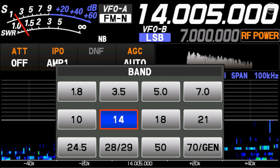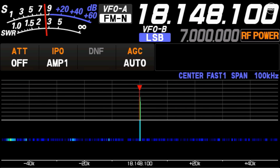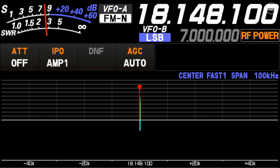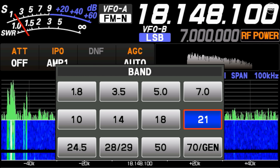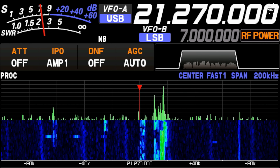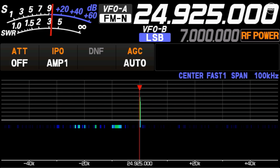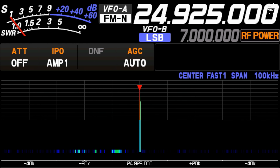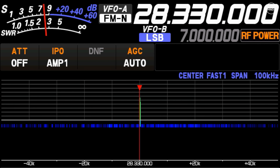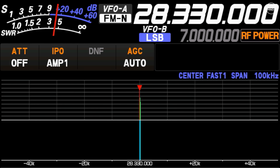The 17 meter band at 18 MHz was able to tune to a level where the radio is kind of happy — just below 3-to-1 — but still not as good as I hoped. I don't think I would use the antenna with such a close margin to 3-to-1. On the 15 meter band it managed an SWR of around 1.7 — again I think it should do better. Surprisingly on the 12 meter band around 24 MHz the ATU-350 achieved a tune close to 1-to-1, which is perfectly usable. On the 10 meter band around 28.3 MHz it settled on a tune offering around 2.8 — again, disappointing.